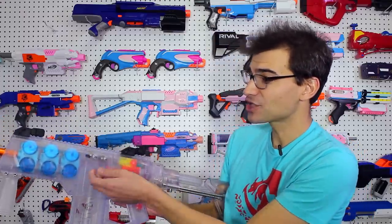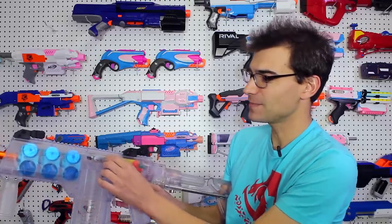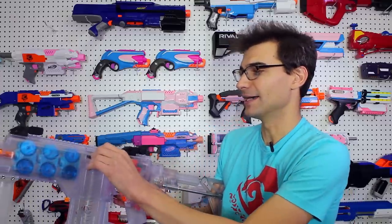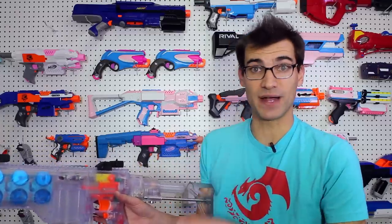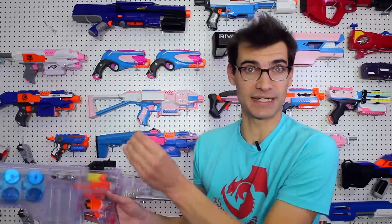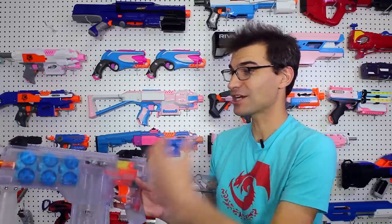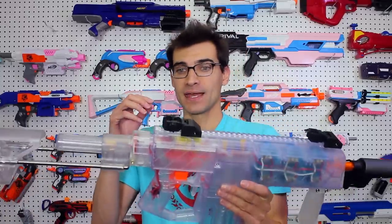You'll notice I don't have the actual knobs on here to look nice and finished, and that's because I made a mistake on the wiring. I didn't give myself enough slack in some of the wires, so if I forced them into perfect position, the solder joints were really stressed and it was not worth it. So it functions, it just doesn't look as pretty as it could. So bear that in mind when you are wiring these up. Give yourself enough slack, enough extra wire to work with to put things where they need to be.